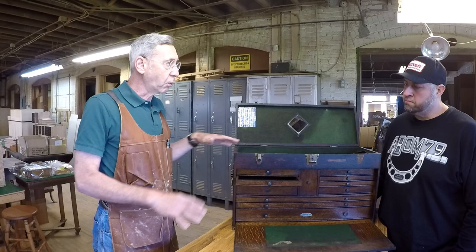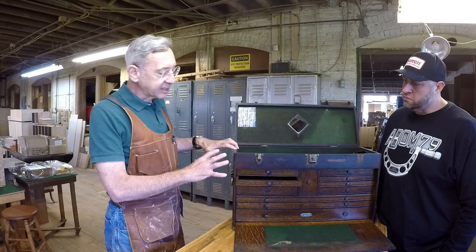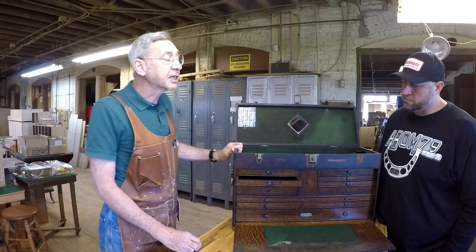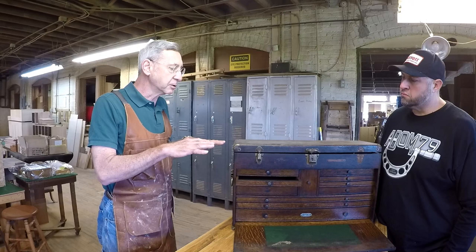Okay, sounds good. It starts off, it says strip and sand the drawer fronts, strip and sand the whole chest. That means that we're going to actually sand off all of the existing finish, put in a new stain, and refinish it. In this case, it's warranted. Sometimes the finish is not in especially bad condition, and we can just clean it. Sometimes folks like the real rustic, beat-up kind of look, and all they want to do is just clean it off, perhaps polish it. In this case, we're going to go right down.